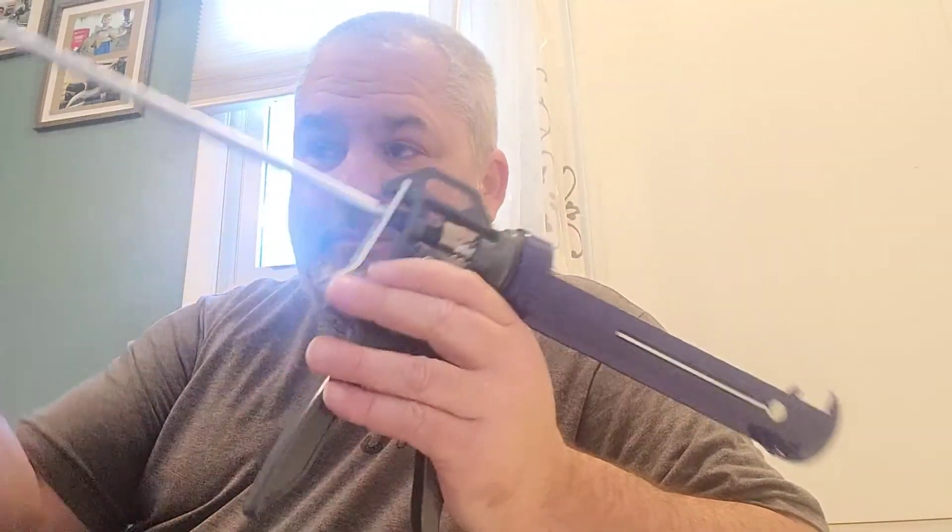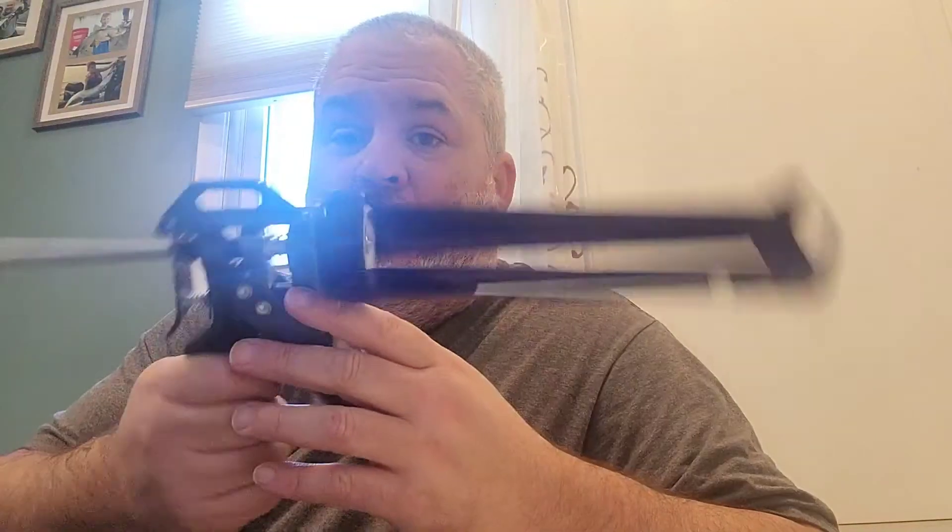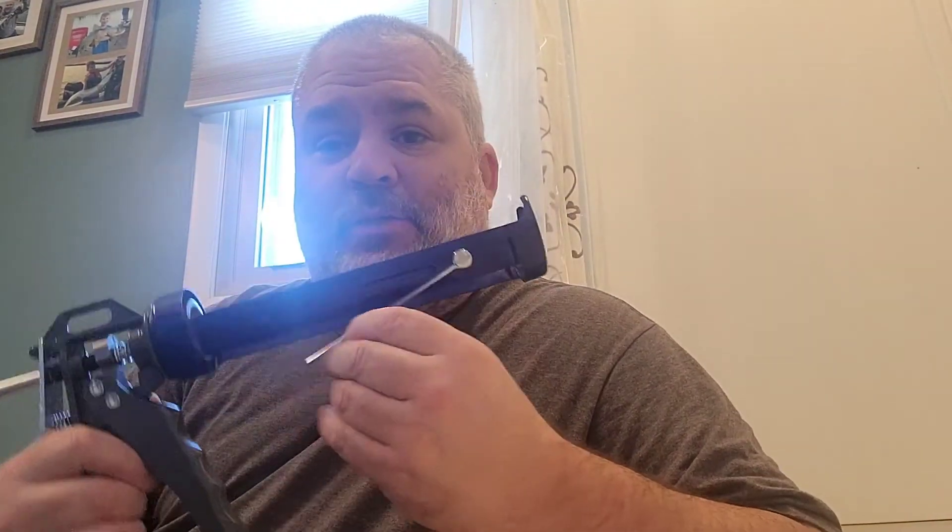You know what this is — good old caulking gun. Pretty decent caulking gun. It's got your needle — sorry about the light in the background, just trying to add some more light here in the bathroom. But this will puncture your barrier. There's a little foil barrier that keeps the caulking in. They also have a knife on the caulking gun right here that you can clip the tip off to whatever size you want. Obviously the more you clip your caulk tip down, the larger your bead and the more waste you're going to have.